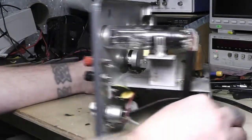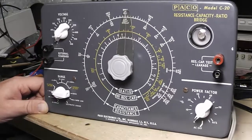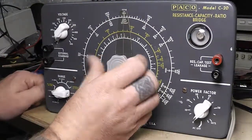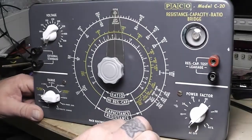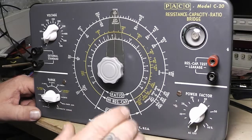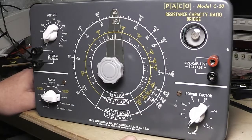So that's a thing to check out. But anyhow, there it is — that's what I did. I'll probably end this video right here and come back in the final video, part three. I'll have the case back on it and we'll go through the alignment procedure, which is real easy. There's this set screw in there — you get your precision resistor or match your resistor. I don't have a precision one; it says 200k to use for alignment. I went through with my modern meter until I found one that was dead on — I think it was 199.999k, so it's barely off. That's close enough.